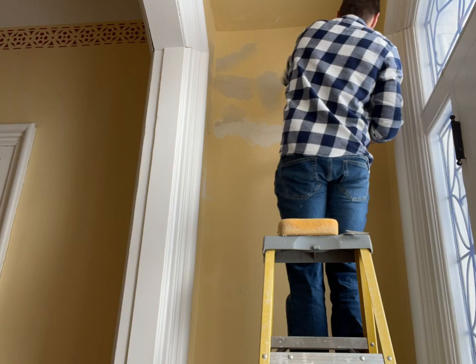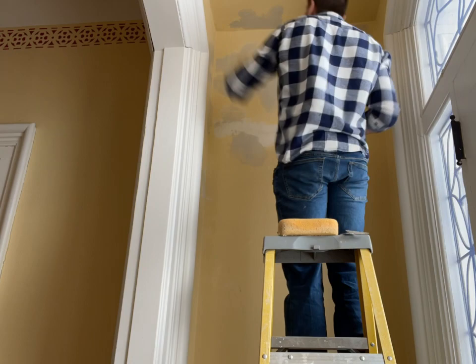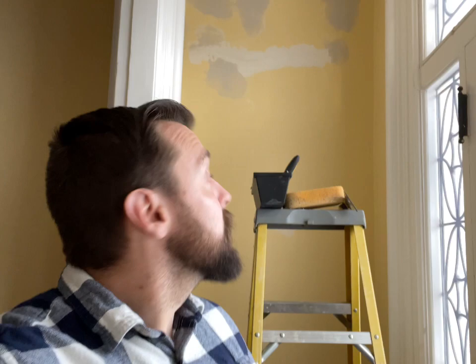Alright, that should wrap up pretty much everything I'm going to do in this little section of the hallway. Obviously there's more but we're not going to take care of that today — I have a showing in a couple hours, so I want to give this a little opportunity to dry and maybe I'll be able to get some sanding done. I'm using a 90-minute joint compound, so I'm just leveling the surface from plaster to paint where the paint has failed. Hopefully I'll be able to sand this soon — some of the cracks were pretty deep so there's a little more mud on this side. And here — nothing to do with painting — but Britney locked herself out and I found it hilarious, please enjoy.